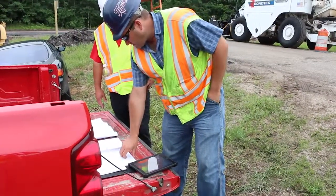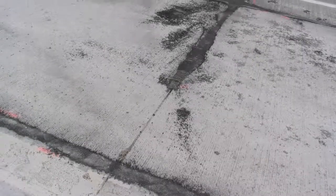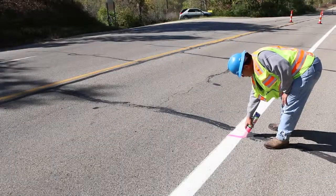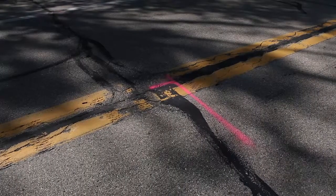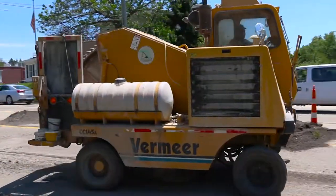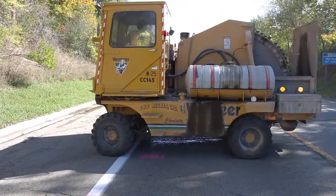Your first task as an inspector is to get familiar with the proposal for the job. In addition to preparing both longitudinal and transverse joints, the work will include some repairing of cracks, HMA patches, and small defective areas on the pavement surface. Typically the inspector marks the portions of the joints and cracks to be removed as well as the bituminous patches and other defective spots. The objective is to remove old joint filler, old HMA patch material, and any deteriorated concrete. Traditionally, grinding machines and backhoes are used for the removal operations.